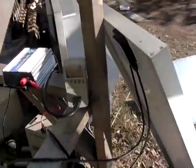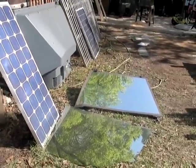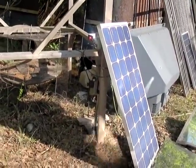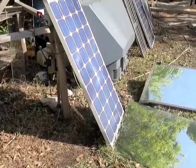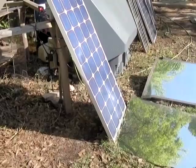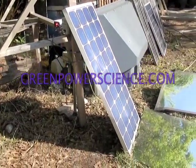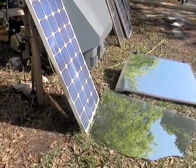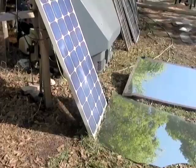I'm going to try one more mirror to see if we can get above 70 watts. This is a piece from the satellite dish that I have yet to complete. I'm shining it over there and you can see it's adding some light onto the panel. Without it we are at 65-66 watts. With the pattern focused on the bottom cells we're seeing 69, 71, 70, 72 watts. It's really important with monocrystalline cells — cells tabbed in series — versus amorphous cells, that you balance the light evenly. If you're using mirrors, spread the light as much as you can across the panel. We are up to 70 watts.